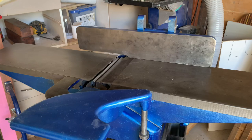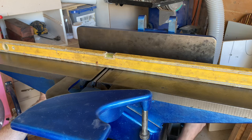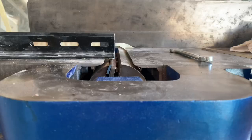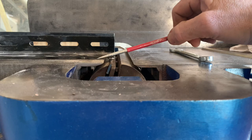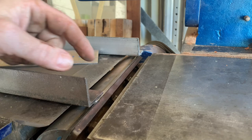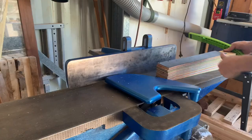All I've pretty much done is put everything back into their exact spots. I've not finely tuned or set it up to work yet, but I still cannot believe how dead-eye straight this thing is. Proof's going to be in the pudding when we start playing with timber. Like you'll see in Vic's video, he's made a quick jig — but I've done the basic concept. I've got some angled steel and rare earth magnets hidden underneath, simply pulling these knives up. I've got two of those set up so the knife is aligned with the outfeed bed. Quick update — I've changed to thicker steel because the magnets wouldn't stick to the aluminium as strongly and kept jumping. The thick stuff is holding it perfectly, so that blade is now aligned much nicer.